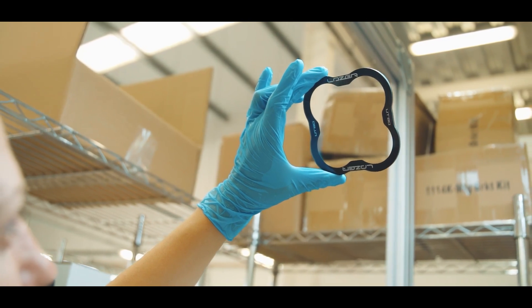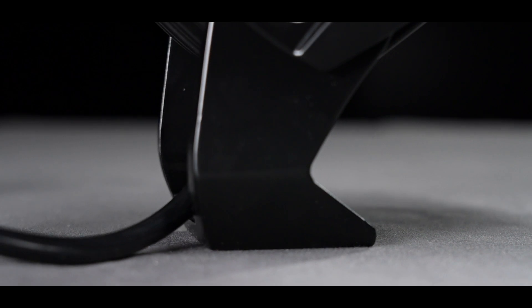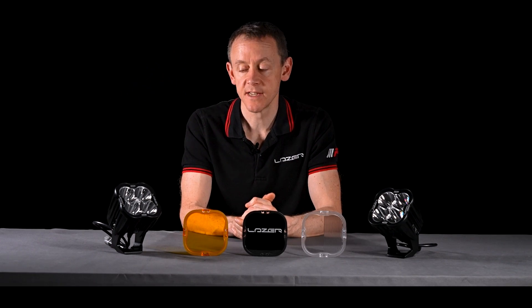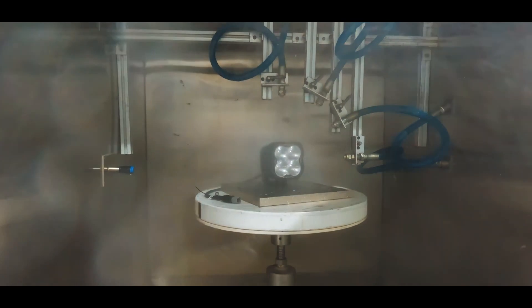These products have a particularly styled design — the lens is completely smooth all the way to the outside, which prevents snow or dust from collecting. The bracket is an aluminium high pressure diecast bracket, and all aluminium parts are powder coated in-house here at Laser, guaranteeing marine grade corrosion resistance. All of our products come with a five year warranty, including the RP series, and these lamps are IP68 rated, meaning you can submerge them for more than half an hour at more than one metre depth.